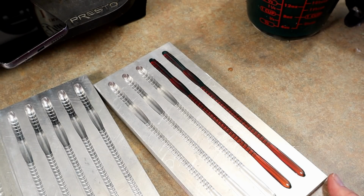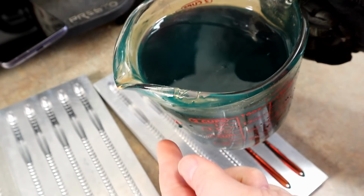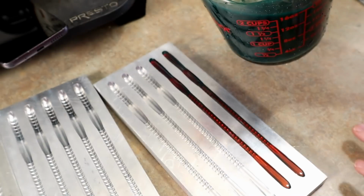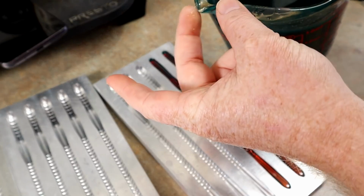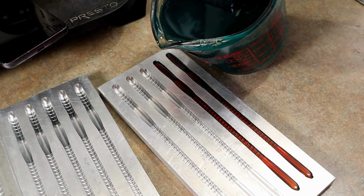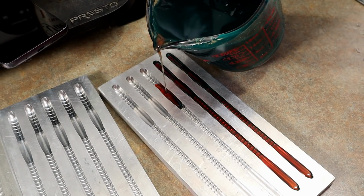Yeah, so far so good. 2 really clean cavities. And one tip is after every cavity, after every pour, try to clean off your nozzle, okay? All of that buildup will eventually come back to bite you. The plastic will start to cool down, and it will start to bunch up on that buildup. And then you're going to get, it just makes a mess. Trust me on that one.